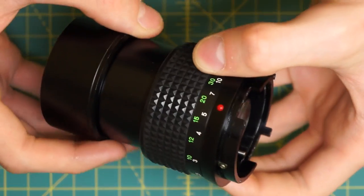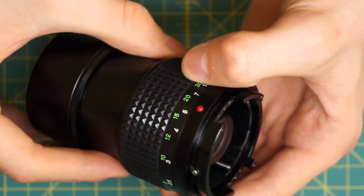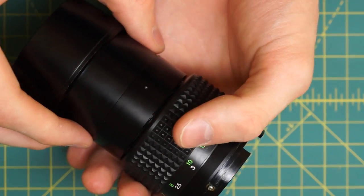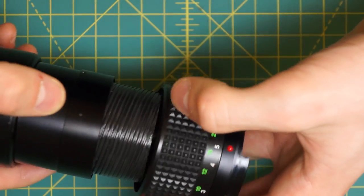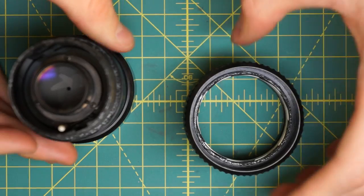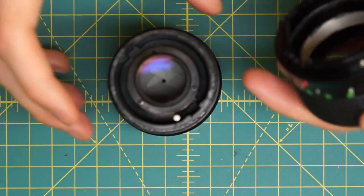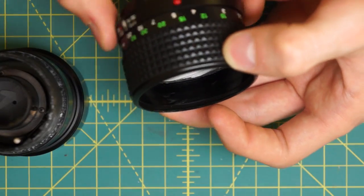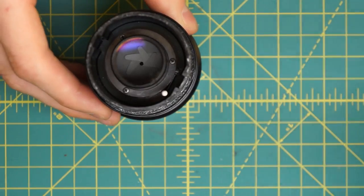With the ring extended out, I'm going to focus it outwards and keep track of where it exits - I like it in this position. There's a little upper screw near the '135' marking that's going to be important. What I've just separated is the focusing ring and depth-of-field ring from the actual main lens body. This lens is a little different in that the focusing ring comes apart along with the depth-of-field scale ring as one piece, which is a somewhat different layout.